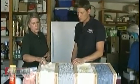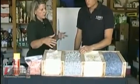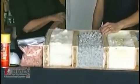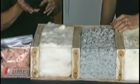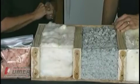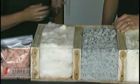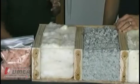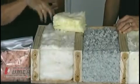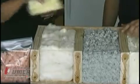You want to make sure that you're fluffy and you haven't compressed it, and then you want to make sure you can come back with pouring more insulation over it to bring it up to the R38 through using cellulose, which is an air barrier. Or you can use fiberglass batt, but you'd need to take the facing off of the batt and then install it perpendicular so that it covers the joist. So it covers up those joists.